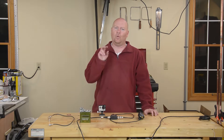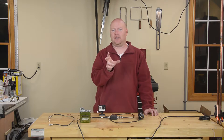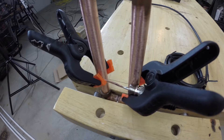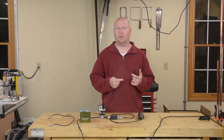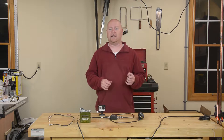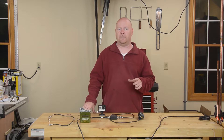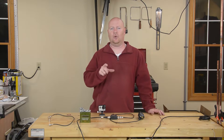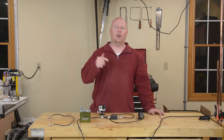Got all the pieces done, so it's time to cobble this thing together and figure out where on the copper J section to attach the coax connector. I have it held on with some plastic spring clamps — not the best attachment ever, but the plastic doesn't interfere with the RF signal pattern. It's good enough for testing and gives me an easy way to move the connection point up and down the antenna until we find the sweet spot.